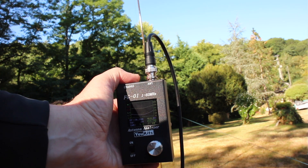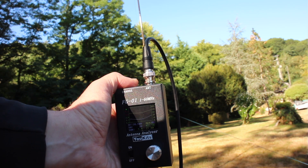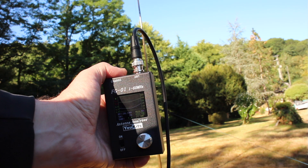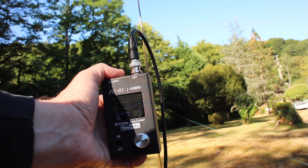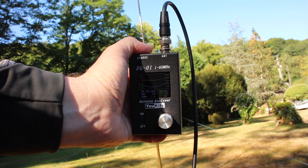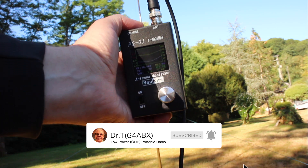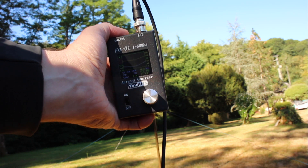21 metres of wire — it's pretty much exactly 21 metres. I could probably improve the SWR if I put the counterpoise on; I haven't got the counterpoise connected. It doesn't need a very long counterpoise — 5 or 6 foot, something like that. I may well do that in the future. It's very difficult for me to check looking at the camera screen, and it's starting to get quite bright here as the sun comes over. I'll say 73s for now, and I hope you have a great day.